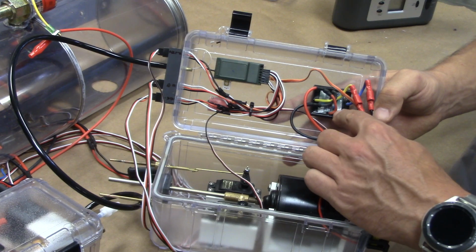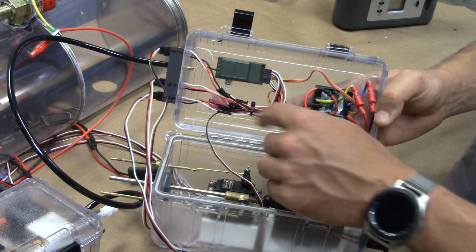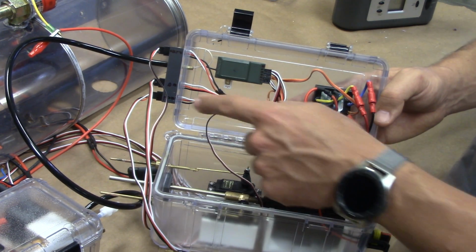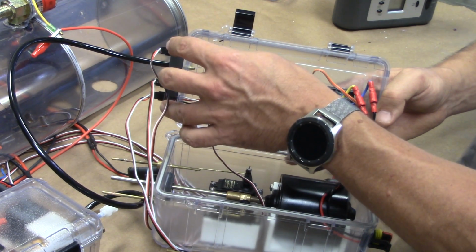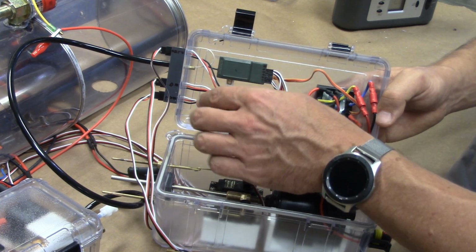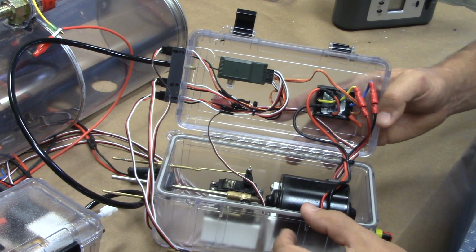And then looking up on the lid, we've got our 40 amp electronic speed controller from Mtronics, our 6-channel receiver, and our electronic pitch controller that automatically controls the rear dive planes there. Here on the top, you can see some servo outputs that I have made some connections for, and these are all physical connections that run directly through this bulkhead, completely sealed off and labeled as to their various functions that move to that forward ballast compartment.